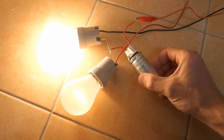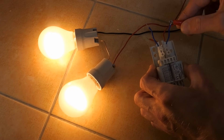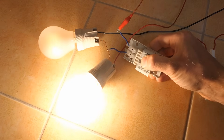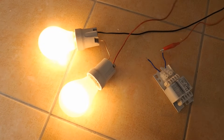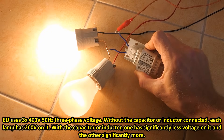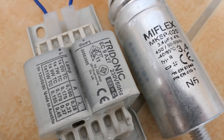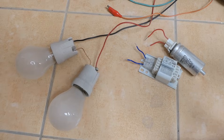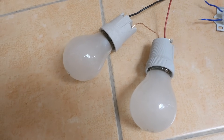Here's a demonstration for completeness — one is way brighter. Let's also try it with an inductor; it should be the other way, and it is. When I swap two phases, it again should be the other way, and it is. For continuous operation you'd have to use a series pair of lamps for each, because the brighter one is getting more than its nominal voltage. To avoid failure in seconds, you'd actually need four lamps — two and two. Even more cumbersome.